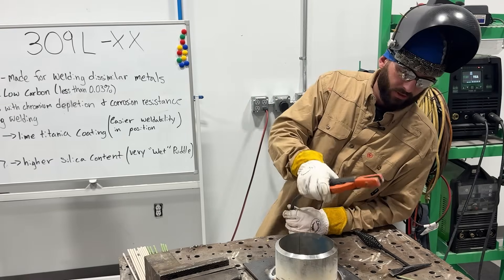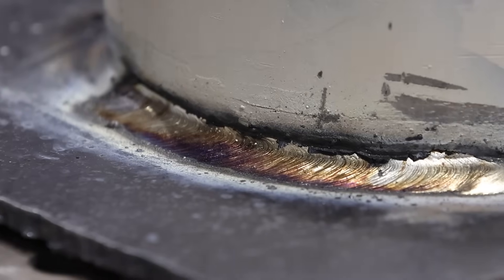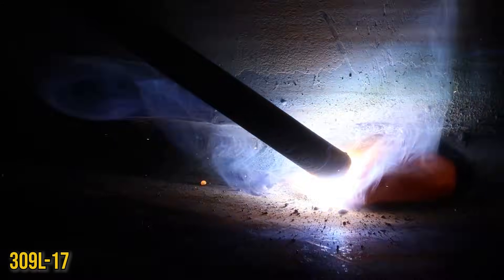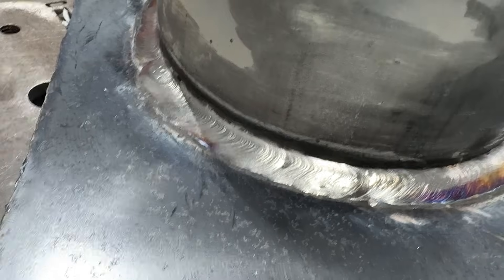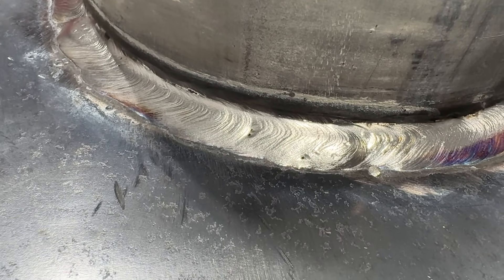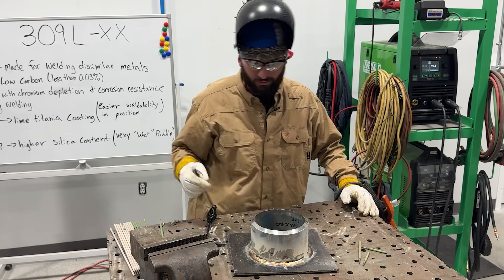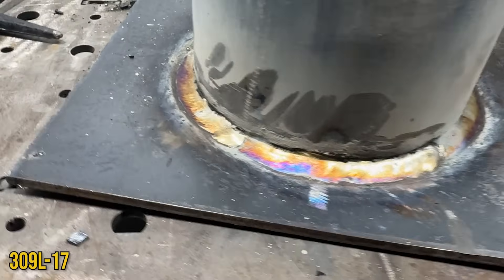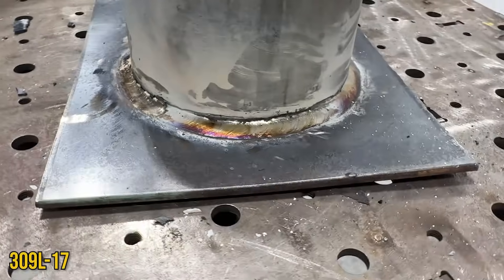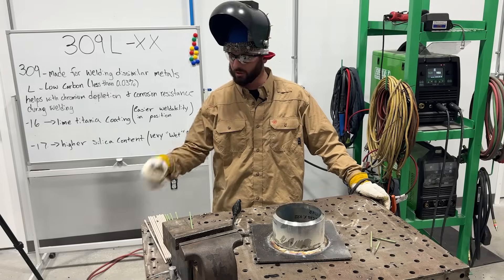It just needs a better welder holding it. I think I got a little pinhole there — a little troublemaker. There are some rules to these rods too: you've got to keep them clean and in a nice safe storage. I'm not sure if you necessarily have to bake out any moisture — these have been sitting in a cabinet in a mostly dry shop. Let us know in the comments what you think about the 309-17 and if it's susceptible to contamination. From my understanding, you do want to be pretty meticulous about keeping things clean. Alright, dash-17 is done — let's switch to the dash-16.